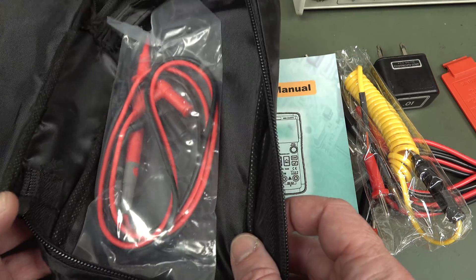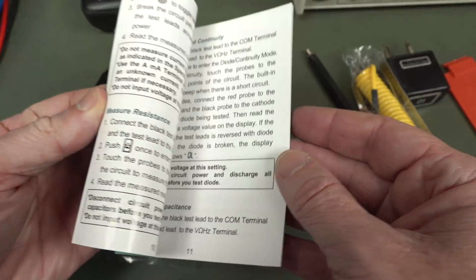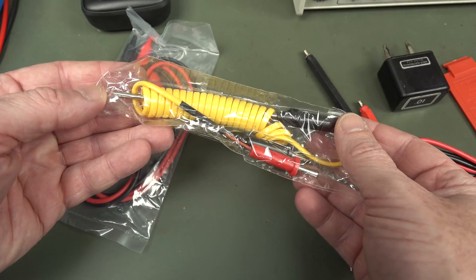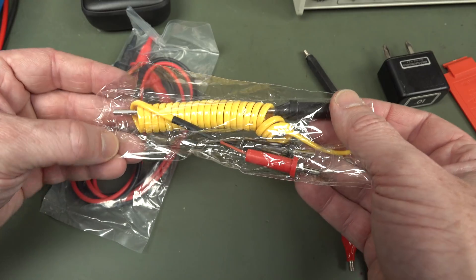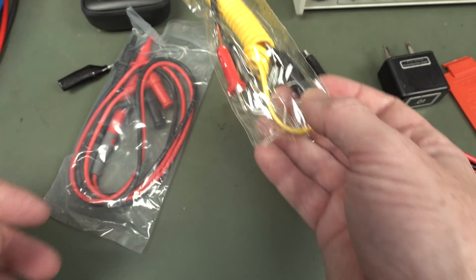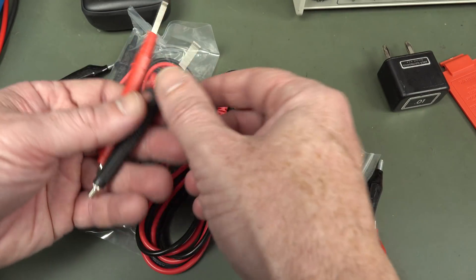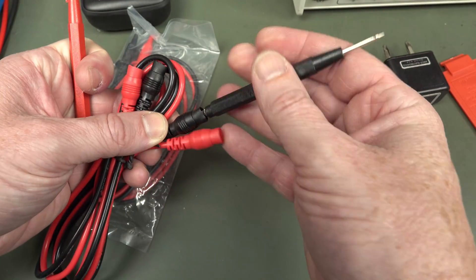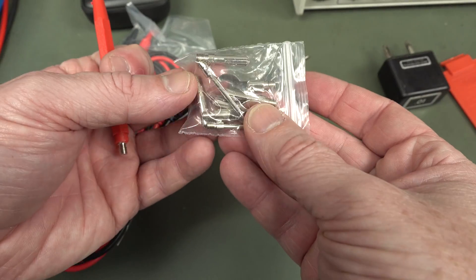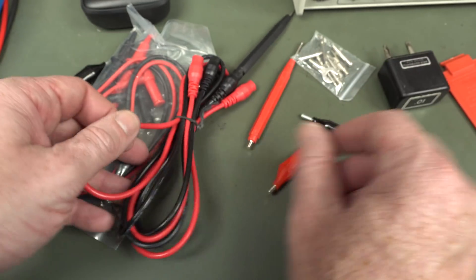Now for your 40 bucks, you do actually get a pouch with the thing, and you get two sets of leads, which is very impressive. There's a user manual, all in English — it's okay, it's got the specs at the end. And you've got an immersion-type temperature probe — none of those little pinpoint thermocouple-type probes. The immersion ones are quite handy, but sometimes you just want the thermocouple type. You get these removable tip test leads; you can screw them in — I don't like these at all, I think they're really flimsy. You do get a bunch of accessories including spade lugs and banana jacks.